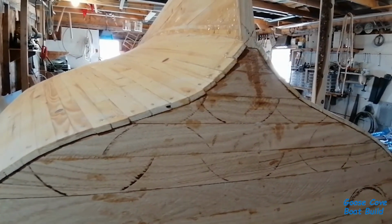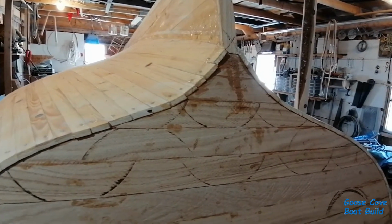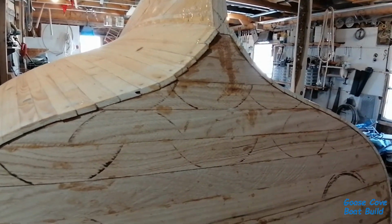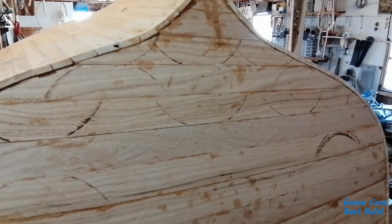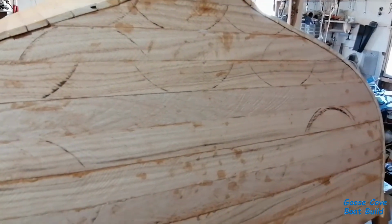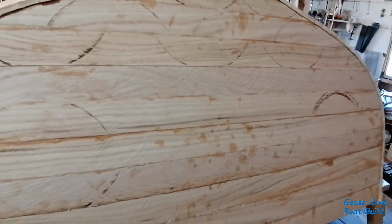Time to sand the transom now. There's a serious overhang on some of the strips there, so I'm going to have to use my angle grinder with a coarse disc on it and be careful sanding it back some until I get it down manageable enough so that I can use my vibrating palm sander to sand the oak strips on the transom.